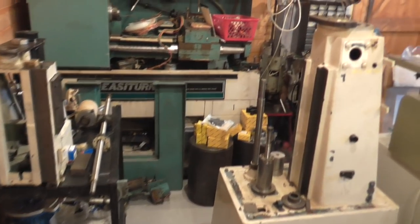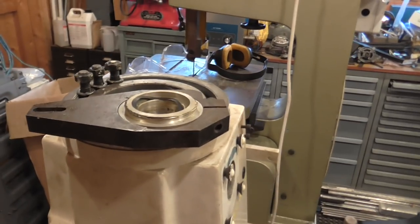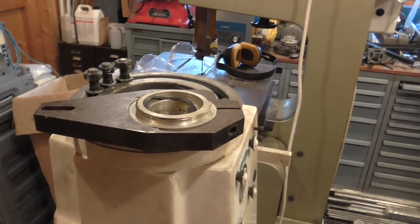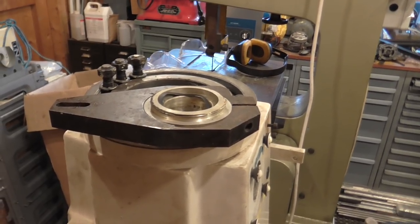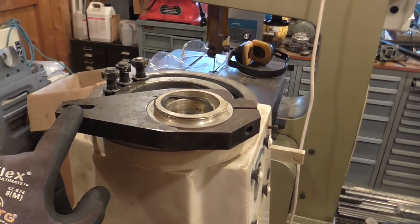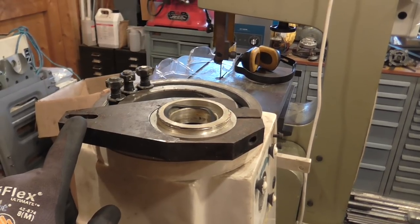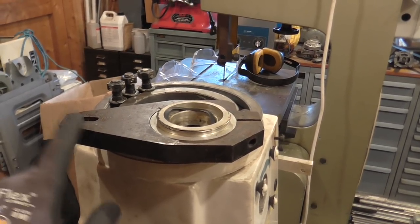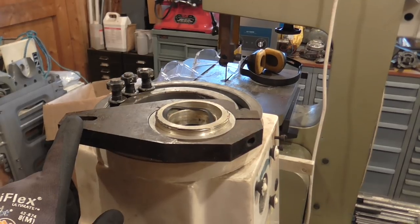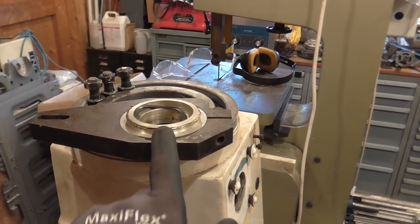Now that actually was one of the real weak points of the machine, and if you see this plate sitting on top of the column, this is how the Z-axis was driven. So in the slot here was the end of the lead screw, the ball screw, and it used a rotating nut design mounted in bearings, with the lead screw being stationary, and it just clamped around the spindle nose.